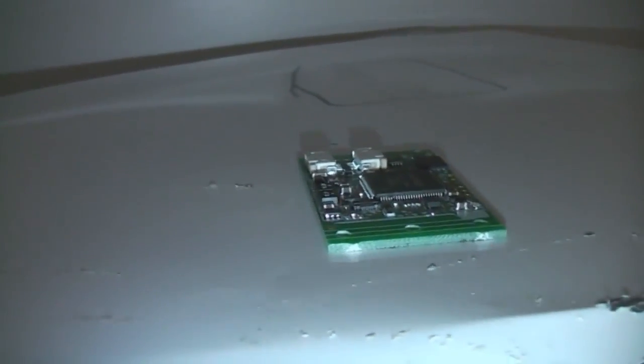Right, this setup seems to work reasonably well. I figured that if we get the screen right next to what we're trying to take an X-ray of, that should reduce the effect of the spot size to some extent, casting a hard shadow directly onto the phosphor. So I just got the piece of that screen material on top of a piece of glass, and then I've got the camera set up with a mirror.